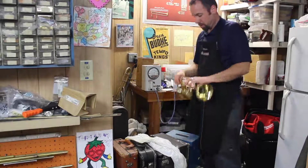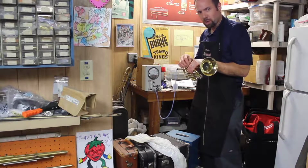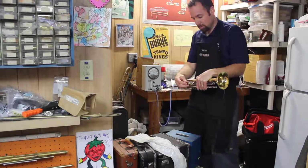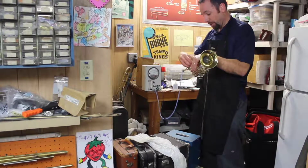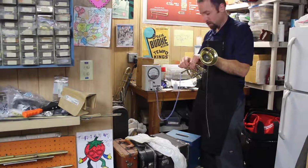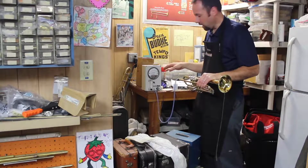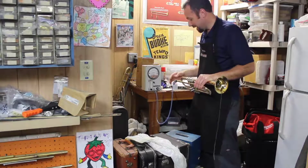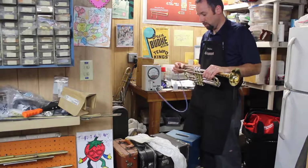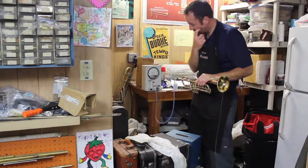So we're back. I got the soldering done. I filled that hole. I checked the before and after pictures, and you can see a nice close-up on those. Now I put the valve back in, and we've got to test it again to see if we no longer have that nasty leak. It was a teeny-weeny leak, and if you recall, it was about 2.8 or 3.0 on the magnahelic. So again, we turn on the mag. It goes all the way to 8 because there's no seal. Bell is plugged. Let's find out if what I did worked.